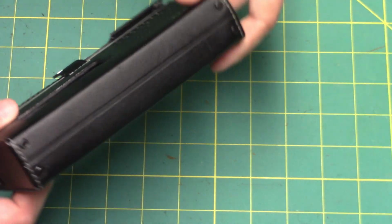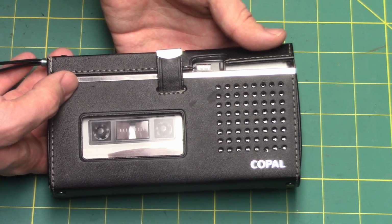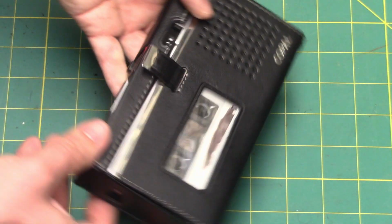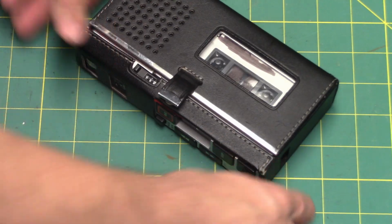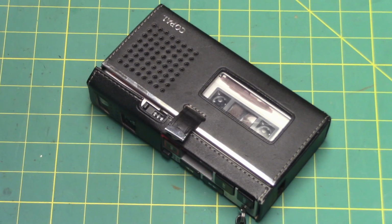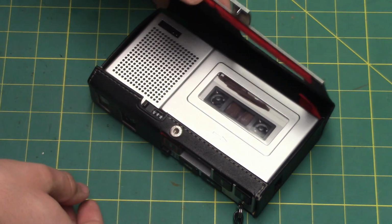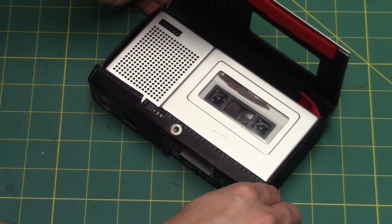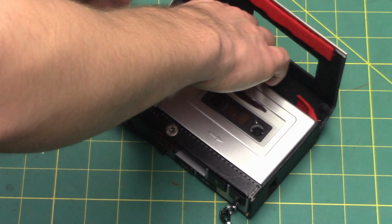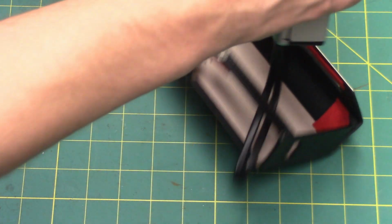It's extremely well made. It uses a dual flywheel design, which means that the machine can be moved about a lot without causing variances in speed, like wow and flutter as it's moved around. So it has a very stable speed, which is delightful, especially for a small-size cassette recorder. It is automatic level control, and very nicely, it even has a little meter on there. Even though it's ALC, you can still see kind of what the recording level is.